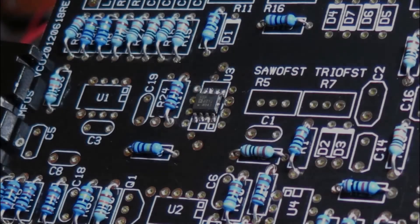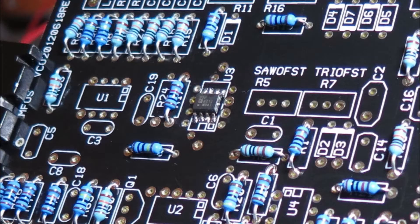So it was time to build this VCO. The first and most challenging step was soldering the surface mount matched transistor pair, the SSM2212. Having done very little surface mount work, this was only the second SMD component soldered in the past year, but it went pretty smoothly. There was too much solder used, but all pins connected properly with no bridges and no need for solder braid to clean up.